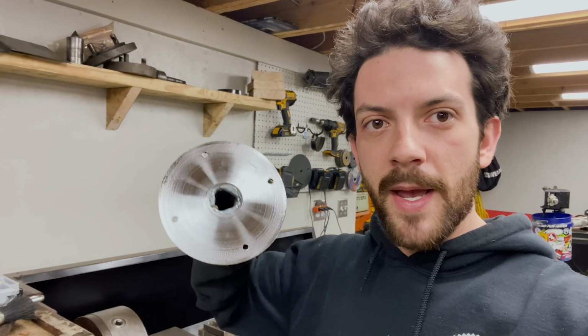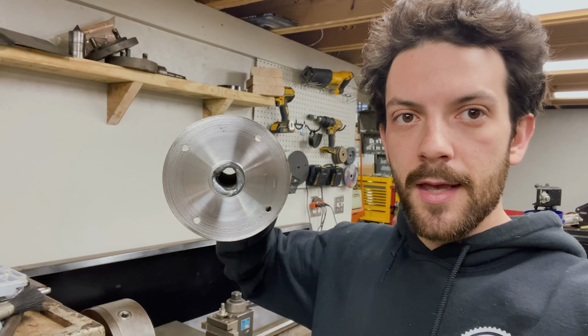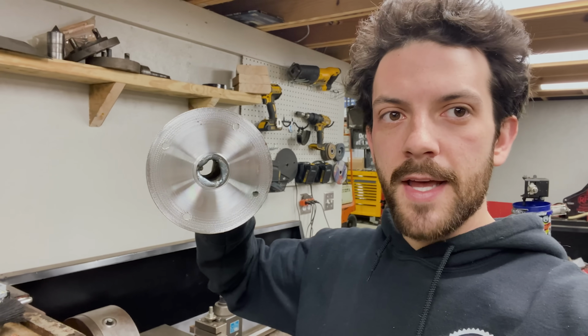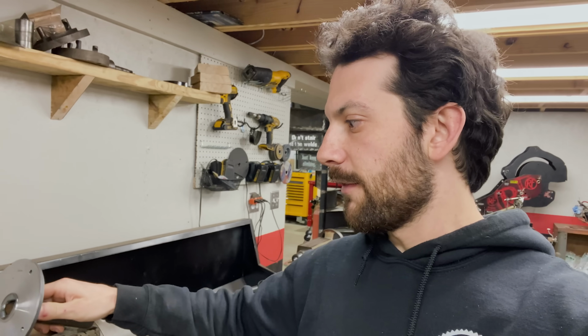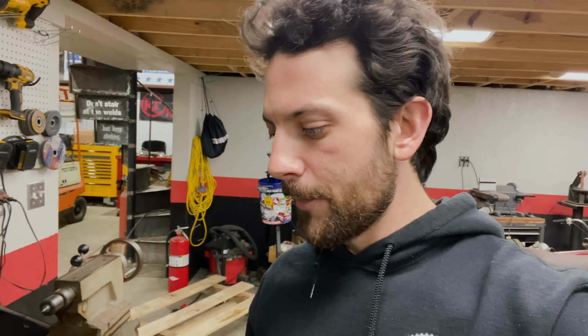When it broke, we were making this fixture right here. This is a piece that we can bolt a Tillotson Predator cylinder head to and basically face the head down. So we can shave a head, not on a belt sander, but on a lathe, and get a good machine finish, and we can know exactly how much we're taking off. So pretty exciting little piece we're making there.